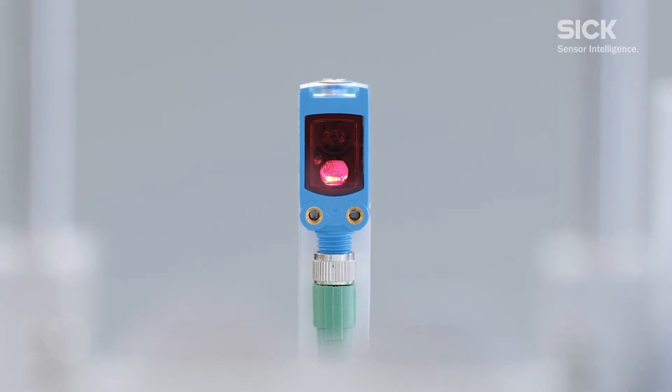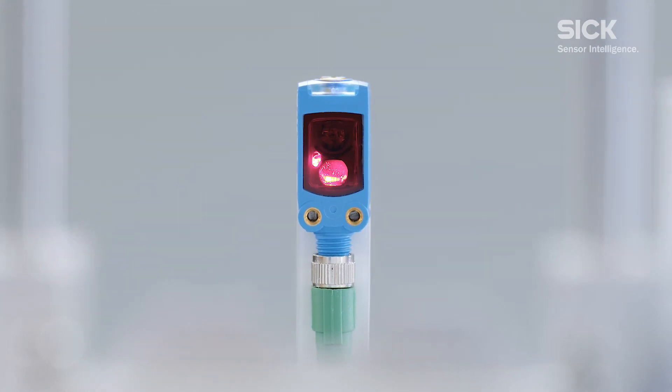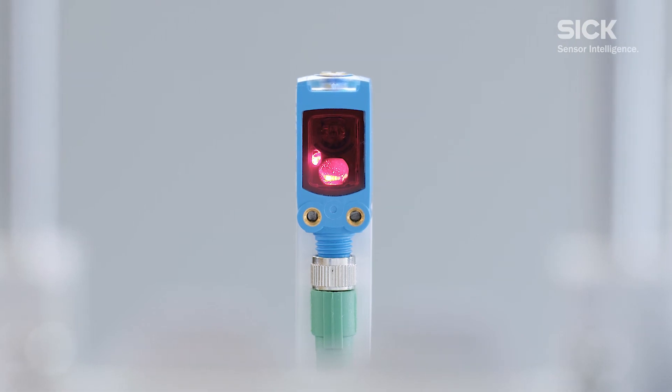What is the second aspect? The second aspect is the so-called diffuse LED. I mentioned earlier that the ASIC is capable of powering multiple LEDs. What we're doing here is equipping many of our sensors with a second LED — a diffuse LED. The diffuse LED illuminates the receiver field of view, which means that two signals are available to the ASIC: the signal from the actual sender LED and the signal from the diffuse LED. This data gives the ASIC the ability to actively detect and suppress reflective objects in the background that could be distracting, such as the infamous safety vest.